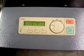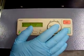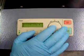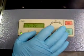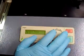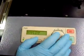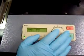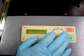Driving time is how long the clutch stays activated. You'll find you don't need to have it activated that long at all. On A, I have it set on 2 of a possible 6. The longer you have this activated, the more likely you're going to pull doubles. Sometimes if you go all the way up to 6, you'll pull 2 to 3 sheets at a time. 2 seems to work properly on A.